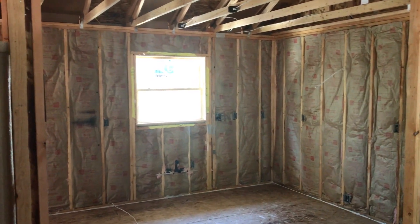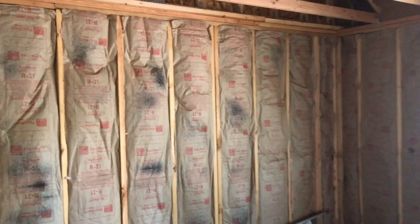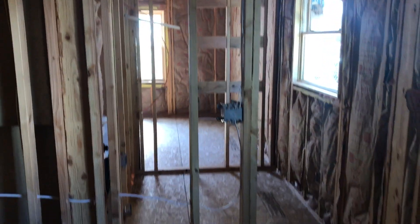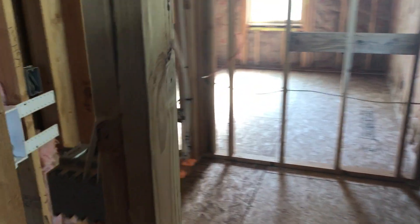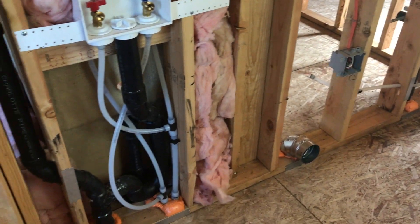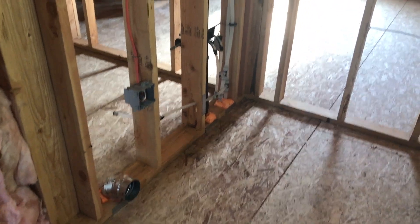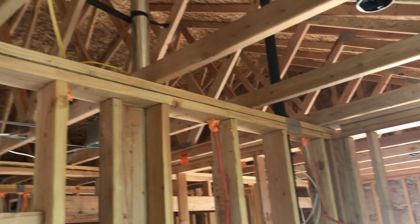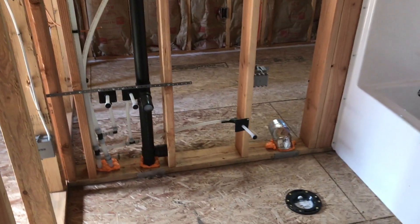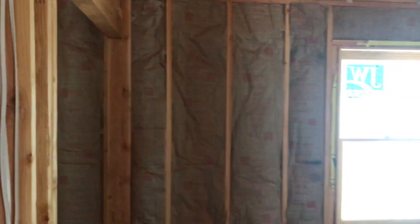This is Tim Olguin. What you're seeing now is the wall insulation installed. Once the rough plumbing and rough electrical inspections are completed, then the wall insulation can be installed. Look at the bottom right on the floor — the inspector wanted the bottom plate caulked for a tighter seal around the inside perimeter of the entire house. You'll notice the foam the insulators put in at the bottom and top plates to seal up any penetrations, keeping out air and possibly any pests. The attic insulation is put in after drywall. We waited to put in the underfloor insulation until we had the roof on — it cost a couple hundred dollars more to have the insulators crawl the floor, but we had rain in June and it would have been a problem if we'd installed it beforehand.